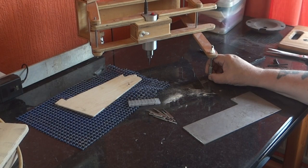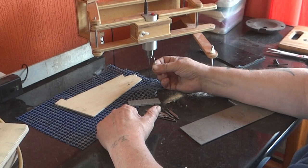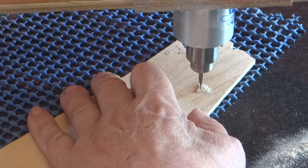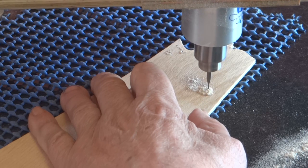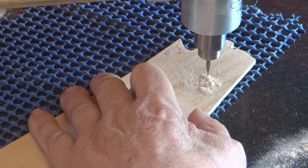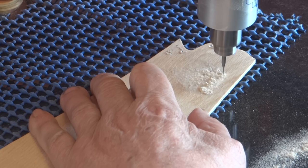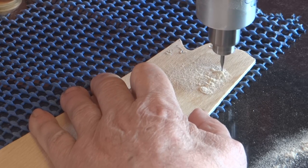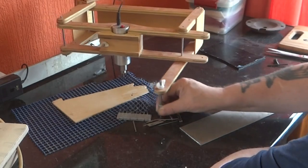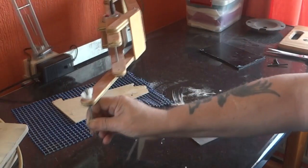Having said that, it's something and nothing — you do get used to it. The bigger tools, that ball-end burr for example, really does grab going across the grain, so you need to keep a lot of control. But because of the 2-to-1 reduction ratio, you're doing big movements here for tiny movements over there. I dither like mad due to a medical condition that makes me shake, but because your hand's resting on the table all the time, I find it remarkably easy to control.